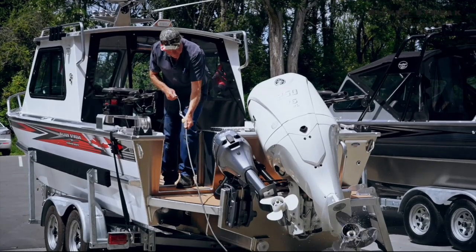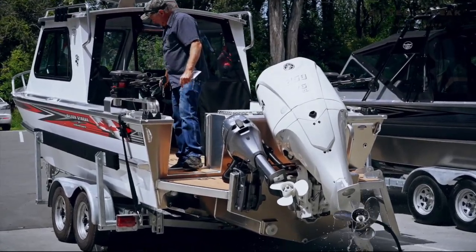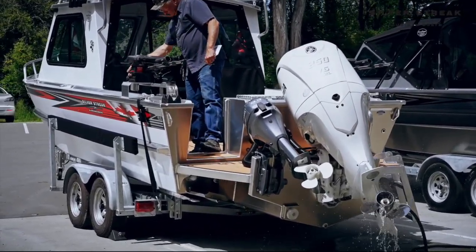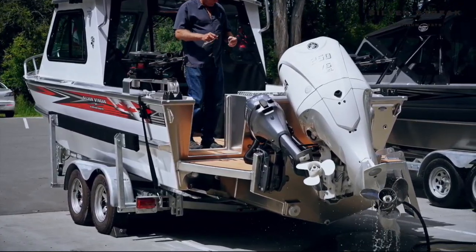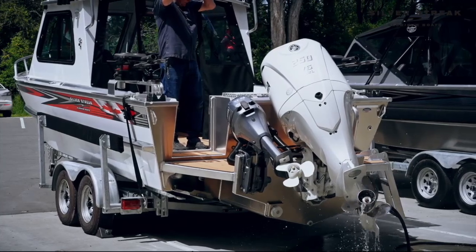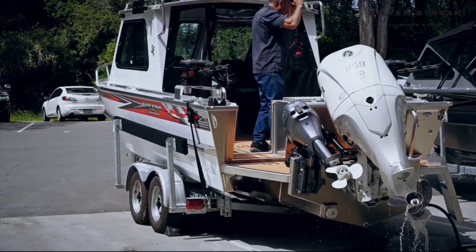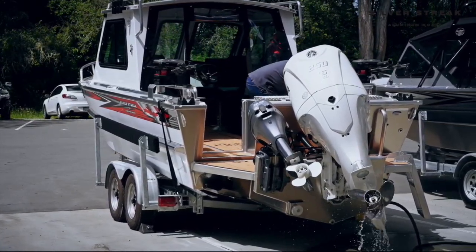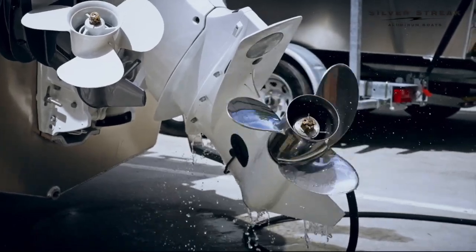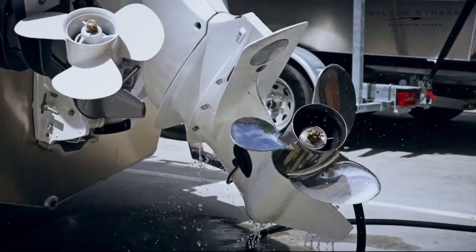Lastly, we want to elaborate on the importance of cleaning your boat regularly, but most importantly, after each use when pulled from the water. Rinsing with fresh water and a non-caustic degreasing soap with the bow up and all drain plugs removed will preserve the health of not only the aluminum, but the canvas, upholsteries, paint, and components. The frequency of cleaning will depend on how often the boat is being used or whether it is being moored.